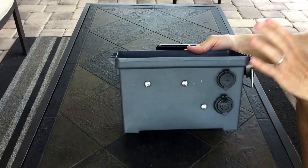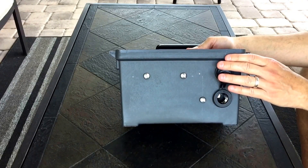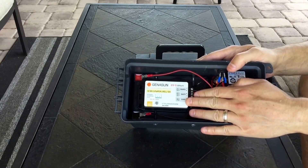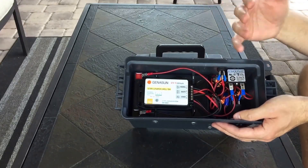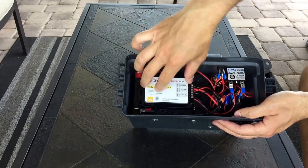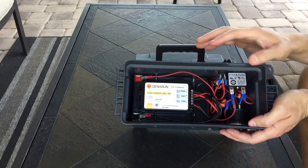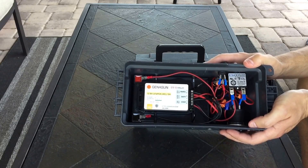I didn't design this for heavy loads. You could hook up an inverter to the 12V socket, but you're not going to power much — maybe a fan or something under 100 watts. I wouldn't go crazy in this build because you're limited to 5 amps, which is 60 watts. Anything more than 60 watts and it will cut off. That's my preference — you can build yours how you want. The controller is held down with a couple of zip ties and it works great; it's really light compared to the SunSaver charge controller I had before.